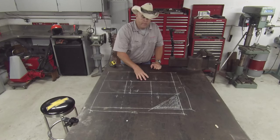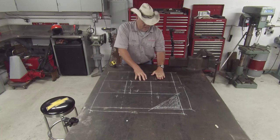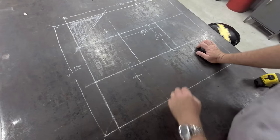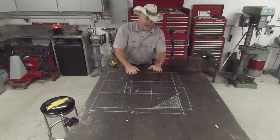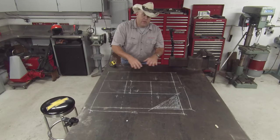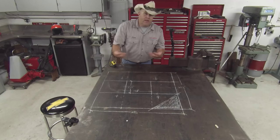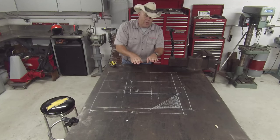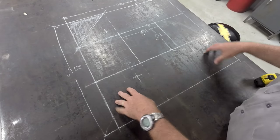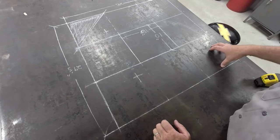I'm going to build one piece that comes down, turns, and turns back up to make a U-shape, and build this other piece separately, then put some 5/16 bolts through so I can bolt it together as one piece. That way if I ever need to take it back down from the windmill, I can just unbolt it, bring it down, paint it, service it, whatever I need to do, then put it back up. So I'm going to go ahead and cut all the tubular parts and lay them out here to mock them up.